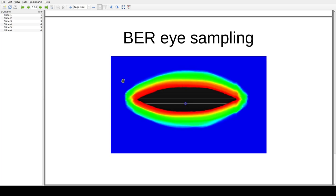If you're used to looking at eyes from a real-time scope, this looks a little different because it only measures BER — we can see the opening on the inside of the eye but cannot see detail on the outside. So you won't see things like overshoot or ripple on the outer edge as long as the inner opening isn't affected. That's a limitation of any BERT or SERDES-based eye scan. The tradeoff is that you're looking at an instrument that costs probably an order of magnitude less than a real-time scope that can make a similar measurement.